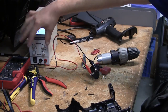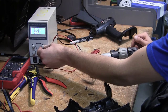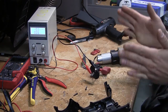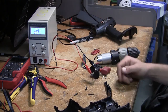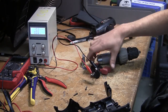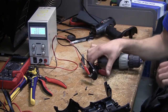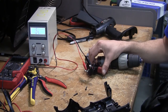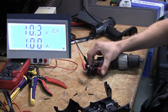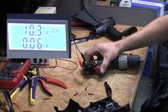I'm going to bring it up to 10 volts and see if that's enough to get it going. Usually with battery-powered circuitry the circuit will run over a range of voltages, so an 18-volt circuit should probably run at 10 volts — let's see if I'm right. It's switched up to 10 volts and I'm going to try pressing the switch. Oh, and look at that — it does work at 10 volts! If you look at the power supply when the switch is fully pressed, it reads one amp: 10 volts at one amp is about 10 watts of electricity.